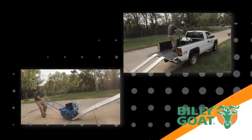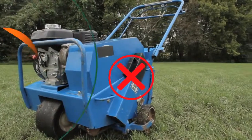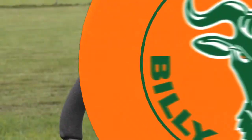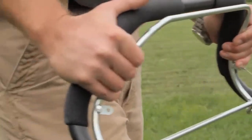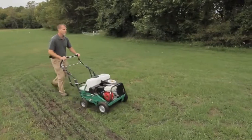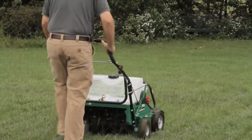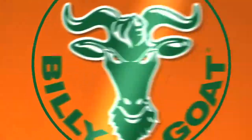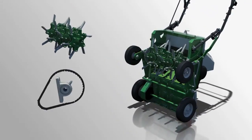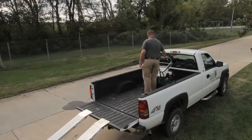Compare how the outboard drive wheels on the AE eliminate both center wheel slip and abuse from ramp loading with the tines engaged, and improve safety. In addition, the unit also eliminates bulky steel weights found on competitive units in favor of a simple-to-fill and drain water weight positioned directly over the tines. Operators who have used competitive older systems love the newer drive system on the Billy Goat that features the softest tine engagement in the industry and the exclusive lift-and-lock disengagement. In fact, an operator can aerate without ever taking their hands off the handle when making passes — simply lift and lock, then re-engage the tine with their knee. The unit also features tilt-up serviceability, thick O-ring chain, greasable pillow block bearings, and replacement tine stars for best-in-class serviceability. Lastly, the fold-and-go handles require no tools to fold for ease of transport and storage.